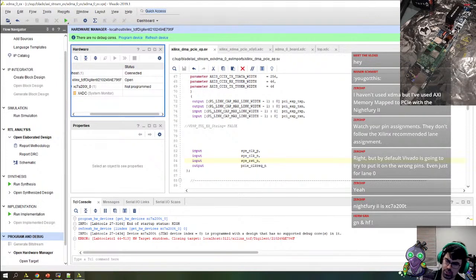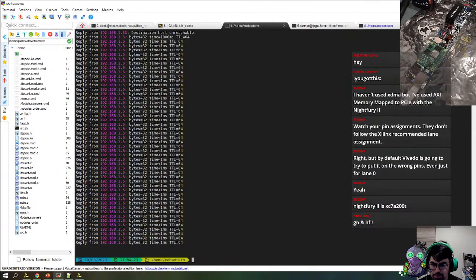If in your FPGA you're doing minor changes and your PCIe BAR address and vendor device ID are identical, you can just add it real quick. You can remove and add from the PCIe bus on Linux easily. But if you change the vendor device ID or change the number of address BARs or the width of the address BARs, you will break the Linux kernel. Good example.